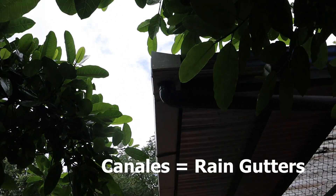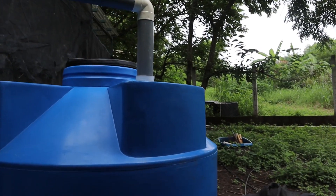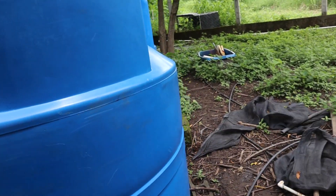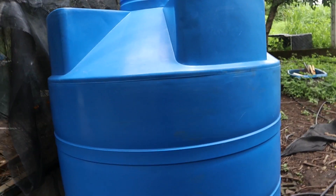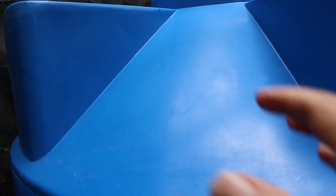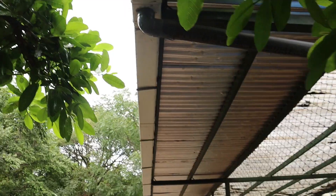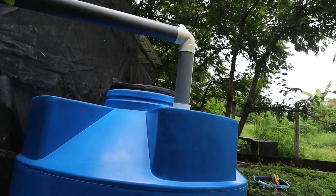Howdy everybody — we're here a couple days later and we've made some changes. The system is finished now. The water comes down from the canales on the roof, goes over in this pipe, comes down, and then goes down into the tanks. You'll notice we eliminated my special bowl invention — it was a good idea, but just not good for this. It overcomplicated things because having that catch-all on there required the tube to be unsupported, and there's no good place to build support here. I've decided I'll ultimately put a screen up where the canal and tube connect, and we'll use the ladder to go up and clean it out. It won't be as convenient, but it'll work.